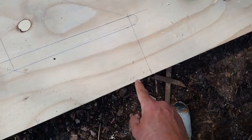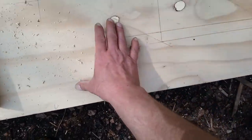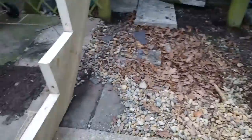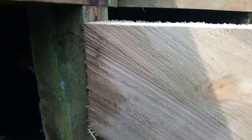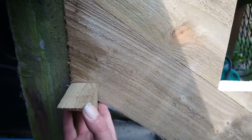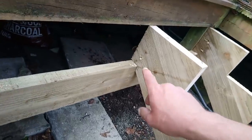This one was always going to be a bit smaller. I think that looks a bit poor actually. I've got some concrete in the van so I'll just get some underneath there. I'm going to find an offcut and notch these so that these timbers are sat on this rail I'm going to put in here. While I'm putting that rail on, I'll get some treatment on these. I've had to fix this one from underneath — they're just notched over there. I screwed them in with coach bolts, coach screws on the inside, and I've just spiked that one.